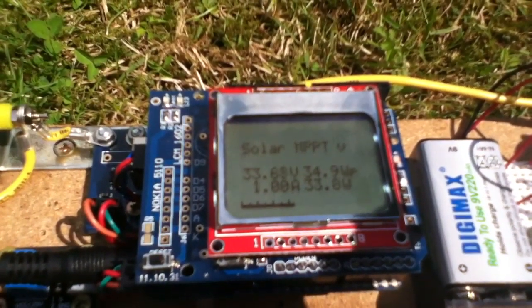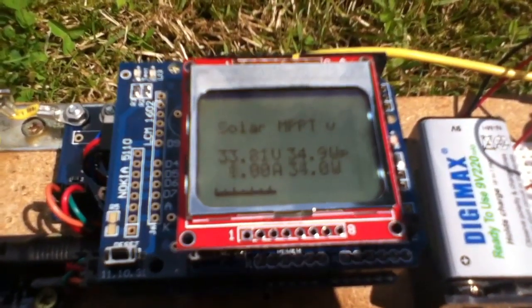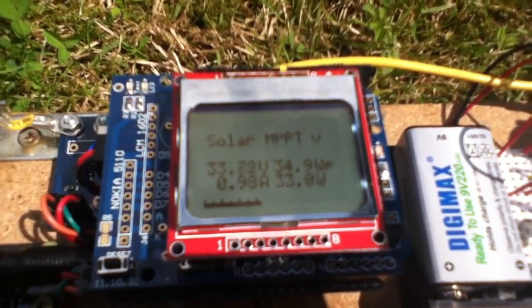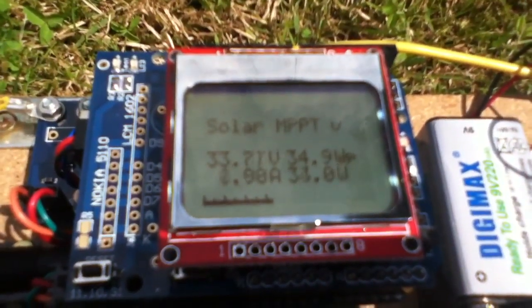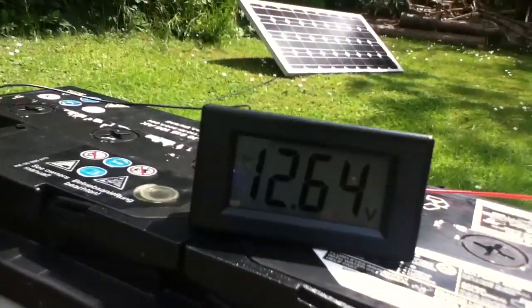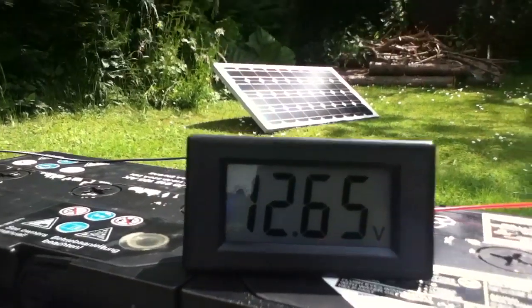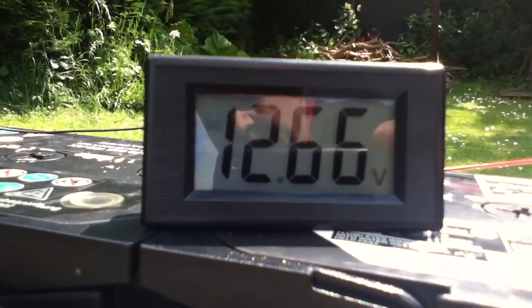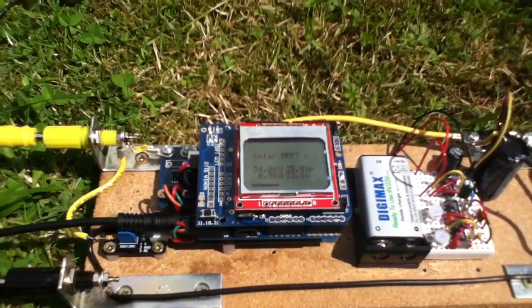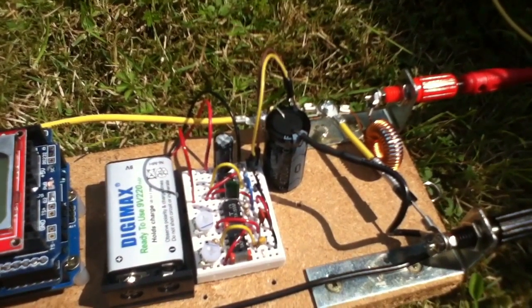It's midday — not quite high sun, that would be 1 p.m. British Summer Time. But we're getting about seven-eighths of the full 40 watts expected from these two 20-watt panels. With 33 watts entering the battery and the bulb drawing 20 watts out, we've got a net flow of about 15 watts into the battery, so the battery voltage should be creeping up slowly. I think that's a reasonably good result, though it's possible the buck converter components aren't optimised for this large voltage conversion.